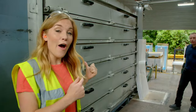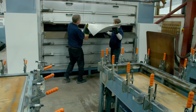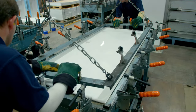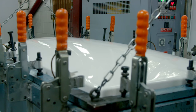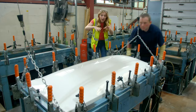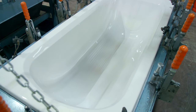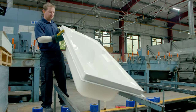The acrylic goes into the oven, which is set at 180 degrees — about the same temperature you might bake a cake in your oven at home. The heat makes the acrylic soft and bendy so it can be moulded into a new shape. After 20 minutes, the acrylic is ready to come out. The acrylic's gone all floppy and wibbly-wobbly! The wobbly acrylic is put onto a machine called the bath tool and clamped into place. Air from tiny holes in the bath tool blows the wobbly acrylic up like a balloon to make the material stretchy, and then the air sucks that wobbly acrylic into the bath tool. Now it looks like the shape of a bath! The acrylic is then left to cool for about five minutes until it becomes a hard shell.